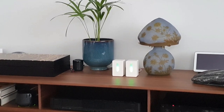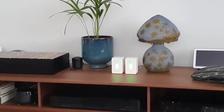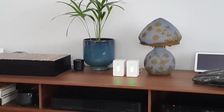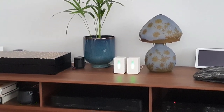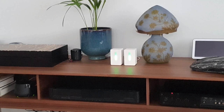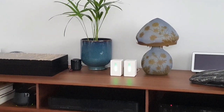On the other one, beside the ESP8266, I also added a millimeter wave sensor 2410 and a BME280 for temperature, humidity and air pressure. I also modified the fan from running at the standard 5 volts - I dropped it to 3.3 volts to reduce noise. Usually the fan is powered by 5 volts and during the day you can barely hear it, but during the night it makes a very annoying whining noise. Lowering the voltage to 3.3V, you can still hear it if you're very close, but during the night at a normal distance you can't hear it anymore.